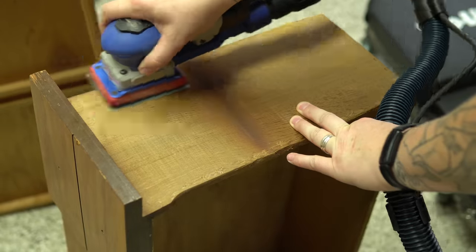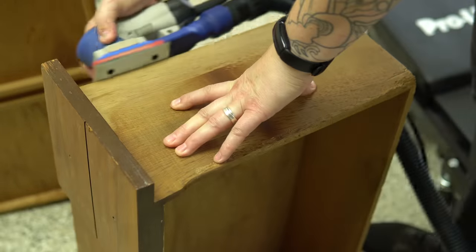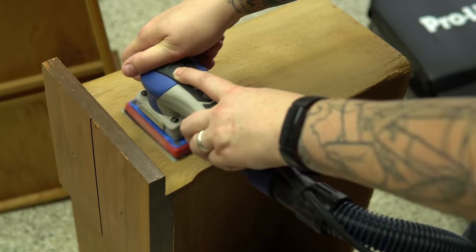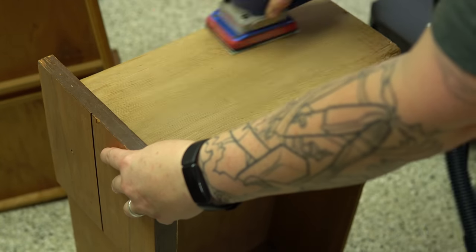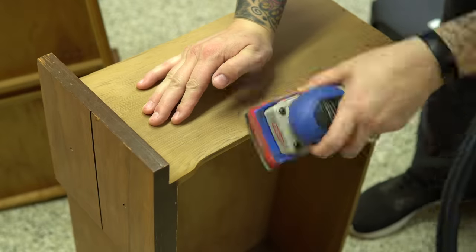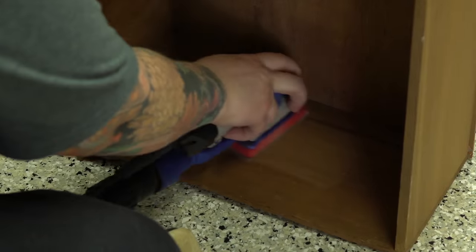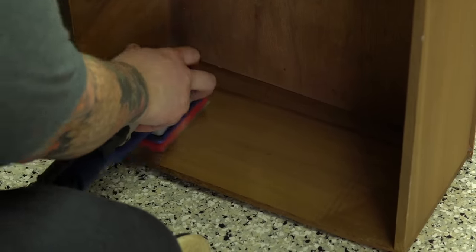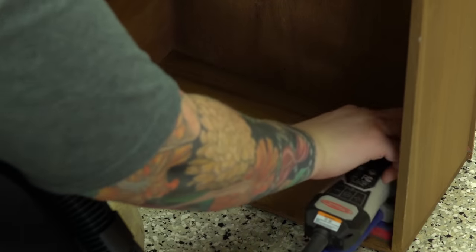The drawers are also a bit dark and dingy, so I'm going to sand them out completely with my SurfPrep 3x4 electric ray sander. I do still use Mr. DeWalt, but on projects like this, where I need to get right into tight corners, this sander is perfect. I'm using a fairly fine grit here. I believe this is a 120 grit.